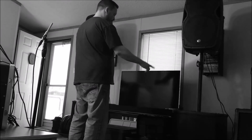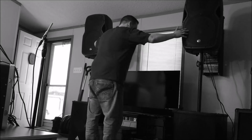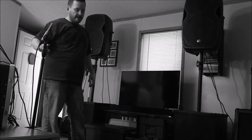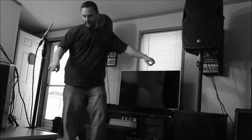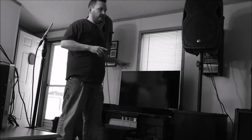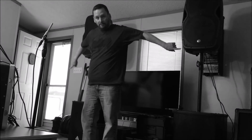For the placement of your RTA mic, you literally want to think of an equilateral triangle. Okay? So I only have these things right next to each other. What is this? 4 feet? So this might be 4 feet. And so I'm going to put this mic triangulated about where a perfect triangle would be between all 3 of them. Okay, so at the club or wherever your venue, you're going to want to put this in a triangulation point between where the tip would be. So this is the base of your triangle, and there's the tip. That's where you want it to be, because it's going to be level, it's going to be measuring left, right, and top, bottom sounds. So you want it to be right there.